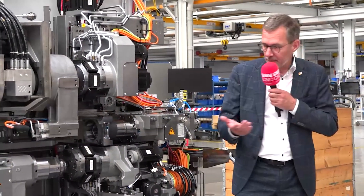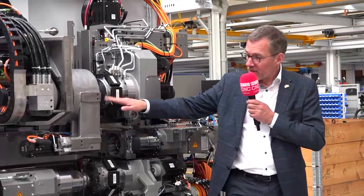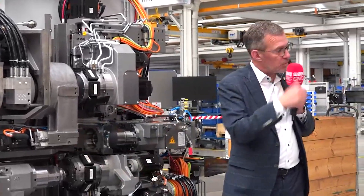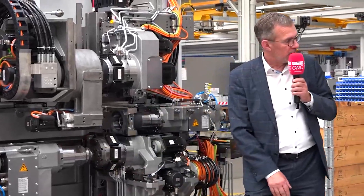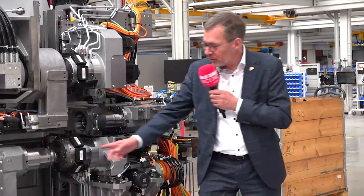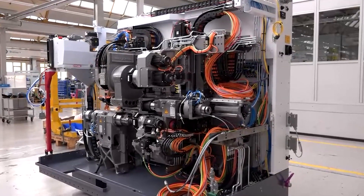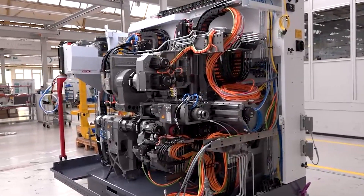Both revolvers are driven and have gearboxes in them. Then we have the fixed tools on this side, which also has a gearbox, so that swivels back and forth. I can have tools in here, but I can also put tools in the front of this revolver, synchronize both spindles so they run together, and use the tooling coming out of here on my back spindle. So I can get four tools in the cut at the same time — I don't know of another manufacturer that can do that.